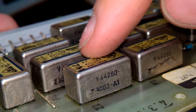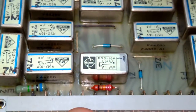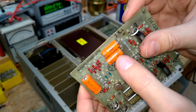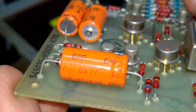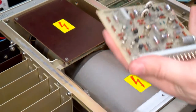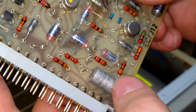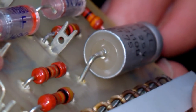This is a third-party component, but Siemens has their own additional item number on it. And one National relay — National Panasonic, I guess. Very nice caps — GPF series, Siemens — again dated 1977. And again these unusual op amps. These caps are called Styroflex — excellent quality, very high Q factor. Siemens MKL metallized paper — amazing caps, really. They are sealed and are of exceptional quality.